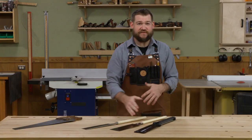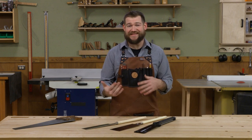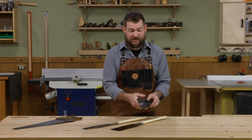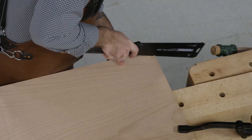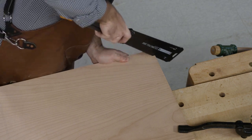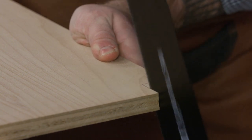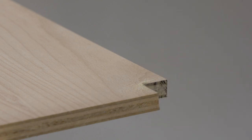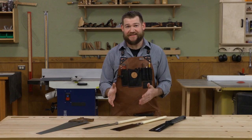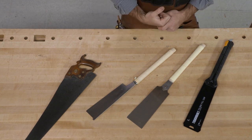These are also useful for cutting sheet stock. If I'm making a project that needs notched corners, this is great to quickly zip those out where a traditional panel saw might be harder to use on the bench. So if you're looking at adding a saw to your shop, take a look at a pull style saw — they're extremely ergonomic, they cut nice, and between the three different styles I think you'll find a place for each in your shop.